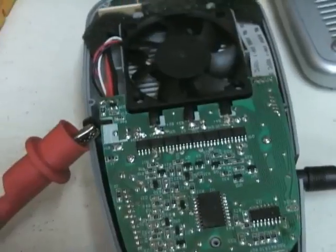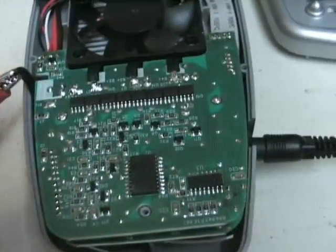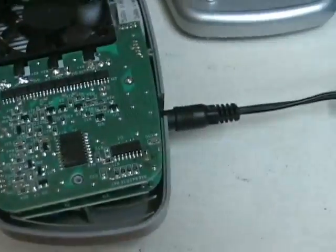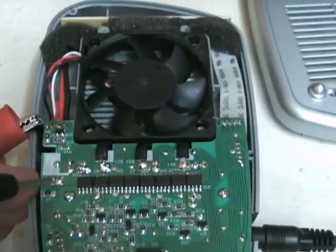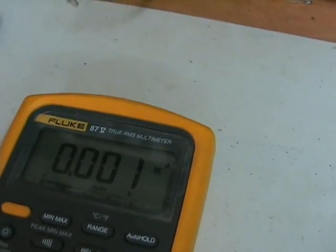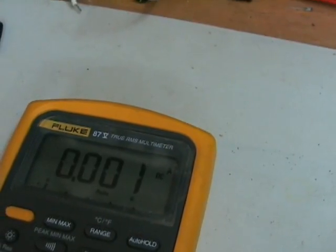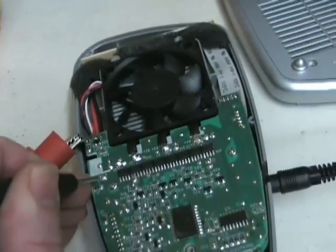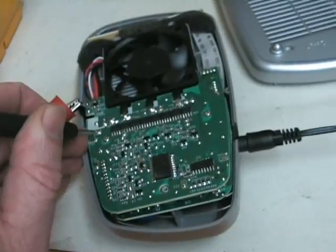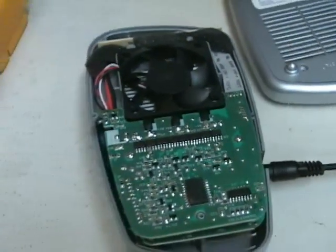What I've done here is desoldered one of the channels and installed a battery on the back. I've got it powered up and I'm going to measure the actual current. Let's turn it on — the fan's going — and bingo: 7.6 amps. It was giving about 7.6 amp pulses before it cut out. That kind of matches the figures we calculated for a 15-minute charge.